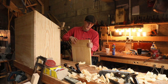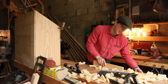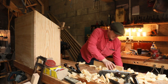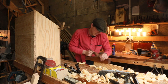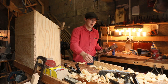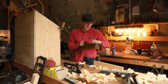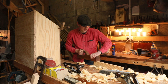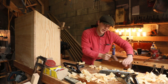I'm not too sure yet how I'm going to cut these parts here. An idea I had was just to chuck them in the vise here. They're actually standing on the floor right now. I have a wooden plane down here — last time I checked it was taking a fairly deep cut, so I reckon I could just use that to bring it down to the level I want. It'll probably cut fairly quick as well. This is a bit oversized here but moving the iron in a bit further we're taking a big fat shaving, which saves the trouble of vising it up to cut a straight line. We'll have it done in no time at all.